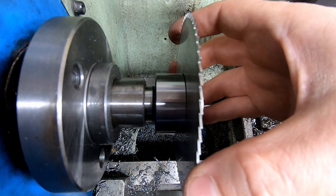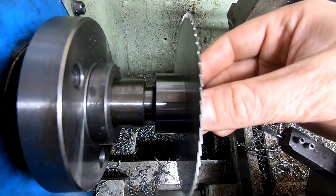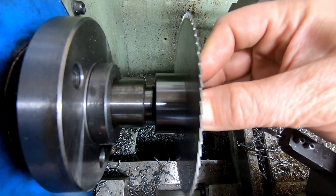There was a little bit of trapped carbide there but I did have to get another cutter and just relieve it ever so slightly more. And that is a perfect flush fit now, so it should clamp up nicely.